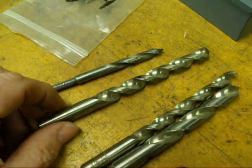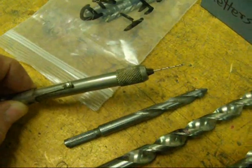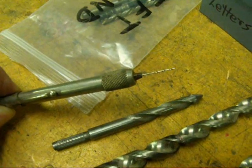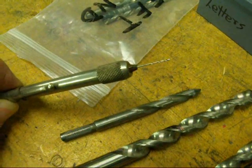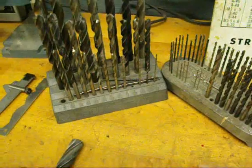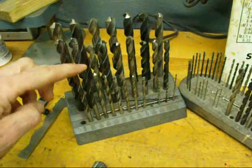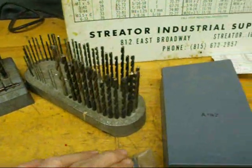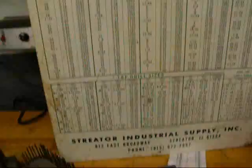As you can see, there are a lot of different kinds of drills. Here's a very tiny drill — they're usually held in a little hand holder and used to drill out your fingernails if you've got blood under there, or to clean out an orifice in a tip of some kind. They're handy. Now the most common drills you're going to use every day are naturally the jobber-length fractional bits, but we also have number bits.